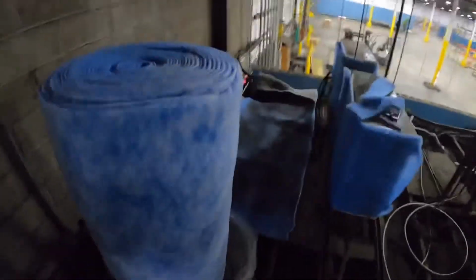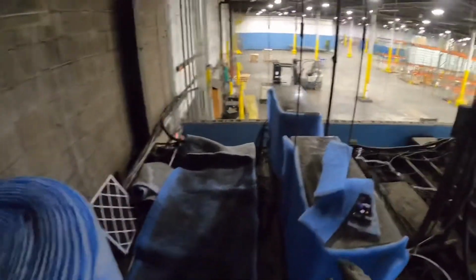Like I said, in my opinion, it'd be much easier to just put these on the roof. And in the long run, coils need to be washed. We can get a hose up there and get some cleaner out and clean them. But most likely, it's not going to be as often as these need to be cleaned, and it's not going to be as nasty. At least you're on a roof, use water and the water just runs off.